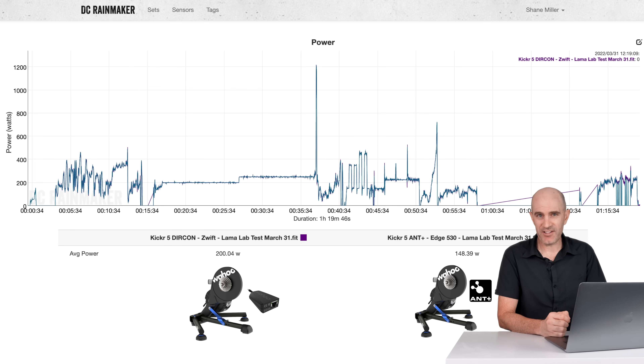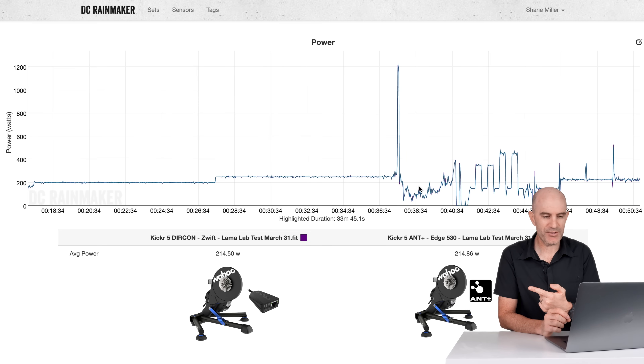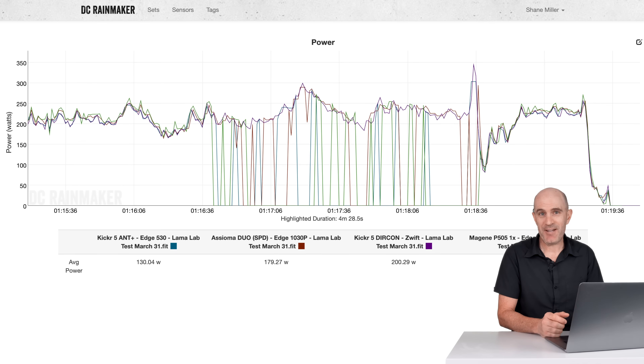Jumping to the DCR Analyzer tool, we compare the dual recordings: Kickr 5 with Direct Connect versus the same Kickr 5 recorded via ANT+. Through the Llama Lab test they're pretty much one-for-one — looking really good — until the microwave oven turns on. One shines and one fails pretty dismally: ANT+ dropping out repeatedly, while Direct Connect on 5 GHz Wi-Fi sails straight through and records data perfectly. Adding all the other ANT+ power meters recorded during the popcorn cooking, connectivity was absolutely horrible — the one standout being the Kickr Direct Connect line, working absolutely perfectly. The lesson: don't use a microwave oven anywhere near ANT devices.